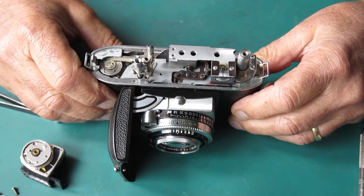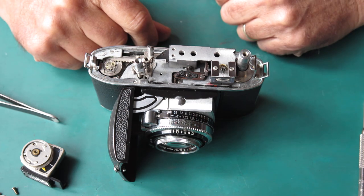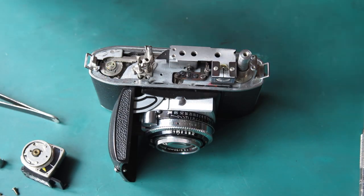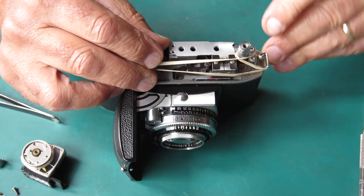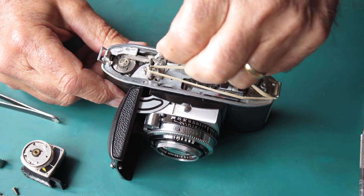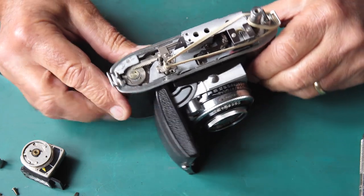So it's important - don't let the shutter release fall out of the camera. What I normally do is put a rubber band around it between here and the strap lug at the other end of the camera. I'll take the button off the top - not taking the whole shaft out - put a rubber band around there and just loop it down to give a bit of tension. That just stops it from falling out. I can take this off - this is our film release button - and remove that with its return spring.